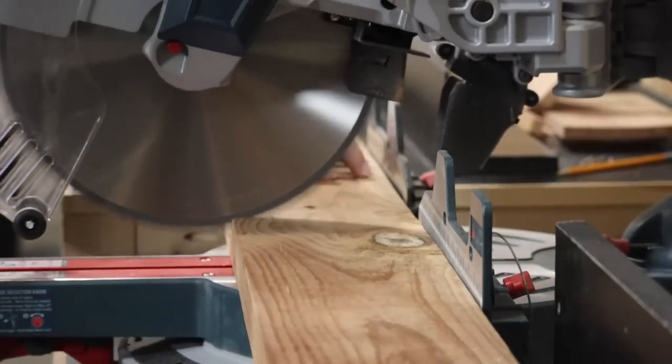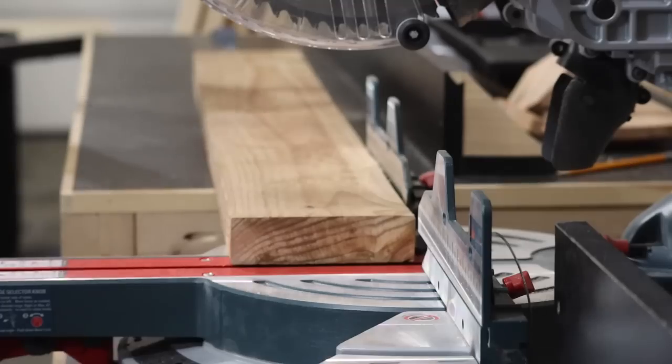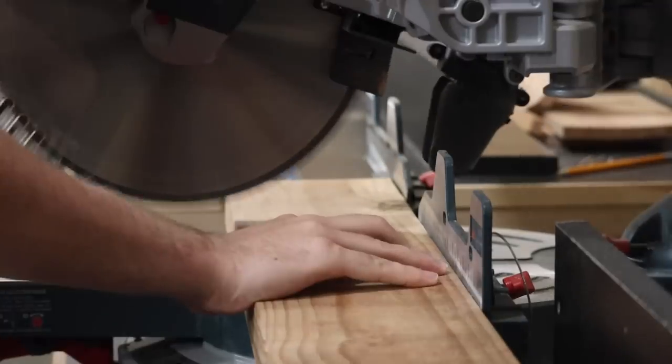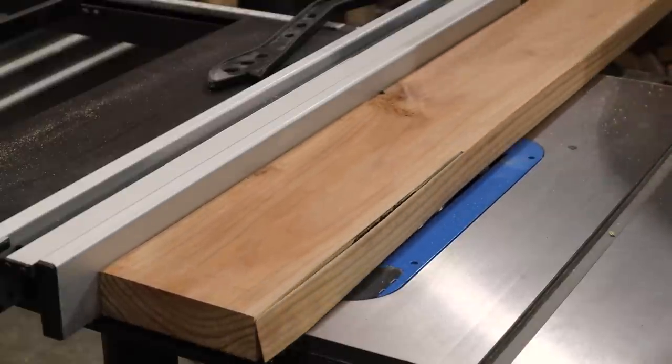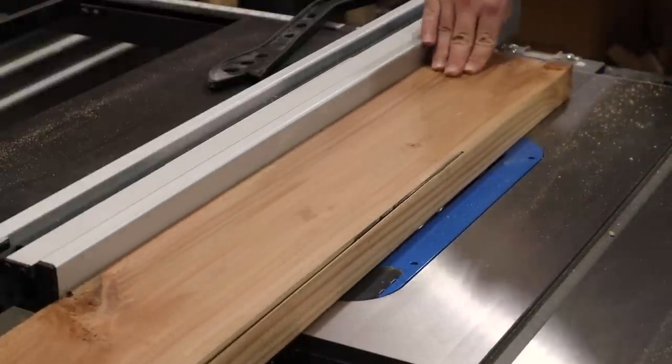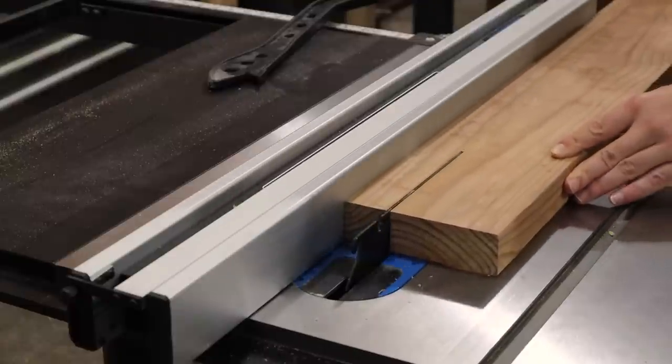For this build I don't need the entire board, so I'm intentionally cutting around the knot holes to leave me with a very clean board. I'm starting off by scoring off the side to get very crisp edges on the frame pieces, then stripping it down to inch-and-a-half width.